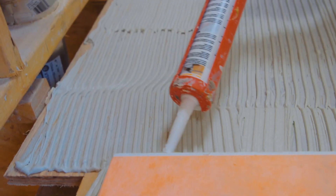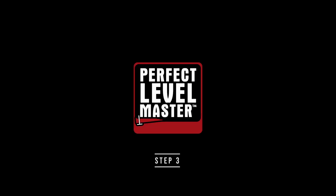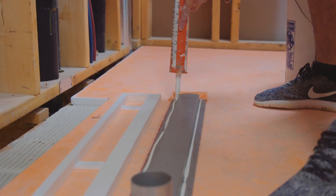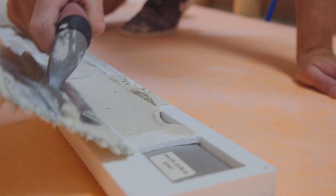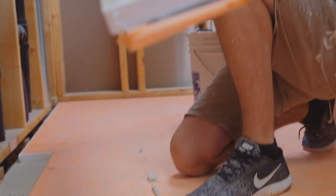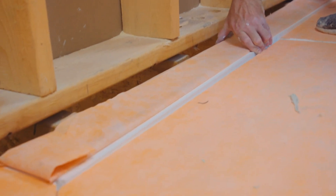It's important to note that once he has attached both trays together, he is using KERDI-FIX — we can also use thinset — but ultimately that seam will still need to be waterproofed with KERDI-BAND. Mack has now installed the channel body support, which was that gray foam spacer that holds the channel body. He's thinsetted everything together as well as used KERDI-FIX as an added extra to ensure that the drain body flange is attached to the support. When installed, you can see that we have the KERDI-MEMBRANE overlapped and folded over top of that line drain. Once Mack is ready to continue with the waterproofing, he will fold that back and tie that drain into the shower tray itself.